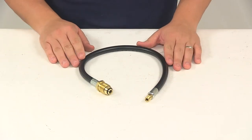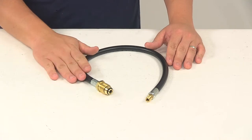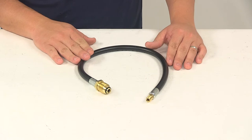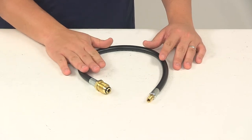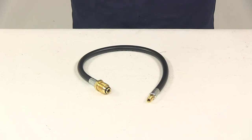The unit is listed — when it comes to certification, it's UL, ANSI, and CSA listed. It's designed for LP gas only, or liquid propane. Please note that this hose assembly does not comply with the RVIA code. So if the dual cylinder system is used incorrectly, this tank connection does not include a back check to contain a gas leak, so please keep that in mind.